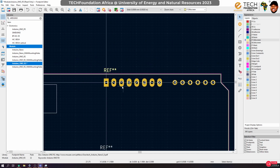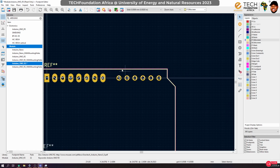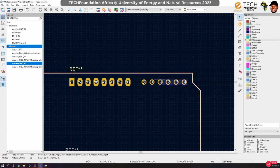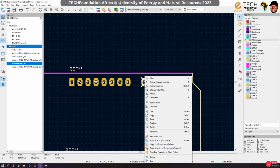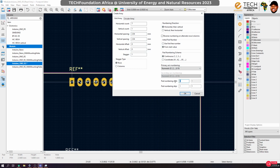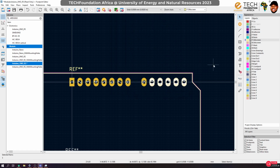So you see now we get 1, 2, 3, 4, 5, 6, 7, 8, right? That's exactly what we needed. Yes, so 1 up to 8. Good. And then we do the same thing for this guy. Again, we delete this. Here we need only 6. We edit this, keep 1.6, change this to 2.54, and then we create the rest, starting from pin number 9. Same thing, but this time we want 6. Let me make sure. So 9 up to 14, that's good.